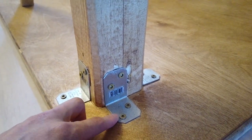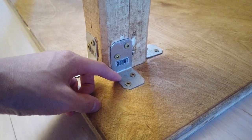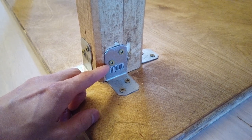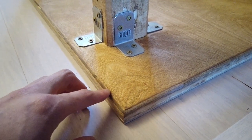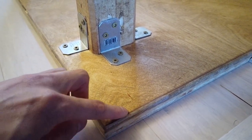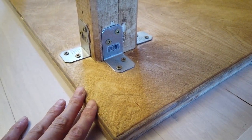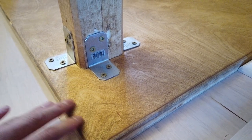I used these metal plates — this one here is 3/4 inch wood screws, and these right here are 1 and 1/4 inch because the bottom is only 3/4 inch maple plywood. I also rounded over the edge with the router just so it has a nicer feel, and then I used Danish oil to finish the top.